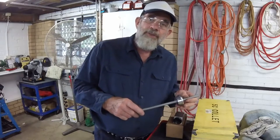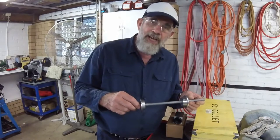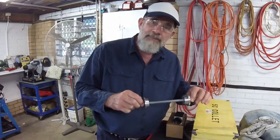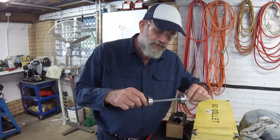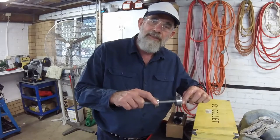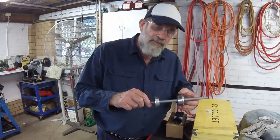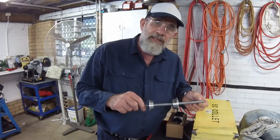The way the bearing installer works is that a shaft runs between the two race installers, and in this case I'm using threaded rod, but essentially it's so that you can draw the two race installers together, pushing the races into the steering head. However, you need to stop the rod from turning, and to do this, I'm going to square the end.